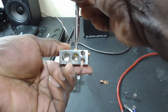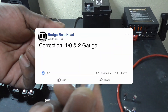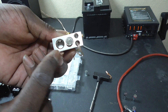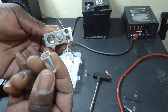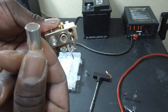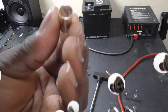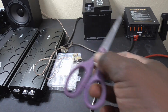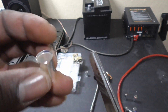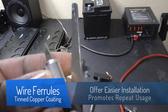Yep, I used a ferrule in there as well. So let's get this going. This is the two-out — ooh, that's a tight fit. So I'm guessing this is supposed to be a one-out. Maybe the ferrule itself is a bit large, or maybe this is just milled a bit too close. So I can make this fit — I'm going to show you how I do that. What you want to do is grab a pair of scissors that'll fit inside the ferrule, and you want to cut it almost up to the lip. It has two ends — one is flared and the other is not. You want to cut the one that is not, starting down here. It's very thin copper.